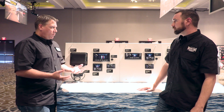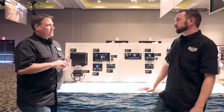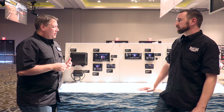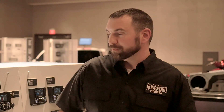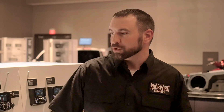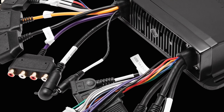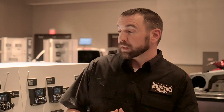Obviously you've got a lot of control and expandability with multiple zone control — being able to adjust the sound elements in each zone with EQ and different crossover elements. As far as inputs and outputs, we literally packed as much as we could into this unit. There are two USB inputs. Each zone has a front, rear, and an independent mono sub output control. There's also an auxiliary input on the back and a camera input, so you can trigger that for a reverse camera or any camera you want to place around the boat.